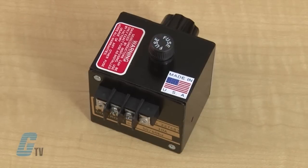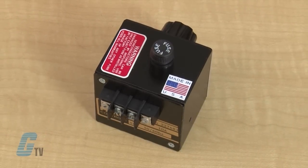The 18-TBP comes in an all-solid-state construction that is compact and lightweight, employs single-hole mounting to panels and enclosure doors, and utilizes an electrically isolated heat sink chassis that allows continuous operation in ambient temperatures from negative 10 to 50 degrees Celsius with no derating.